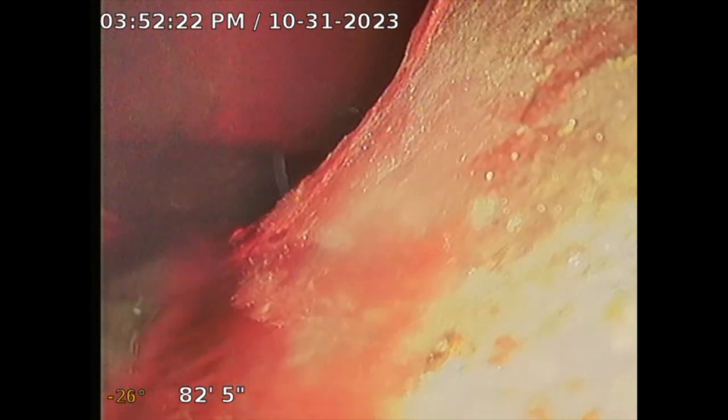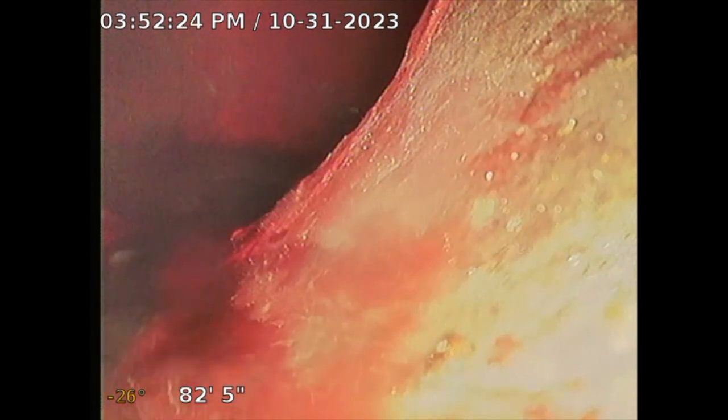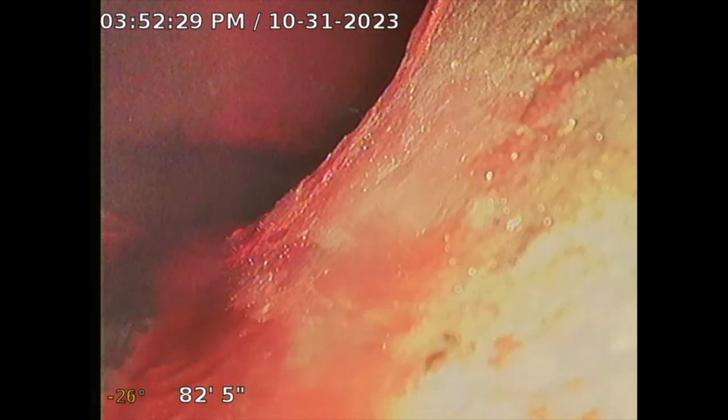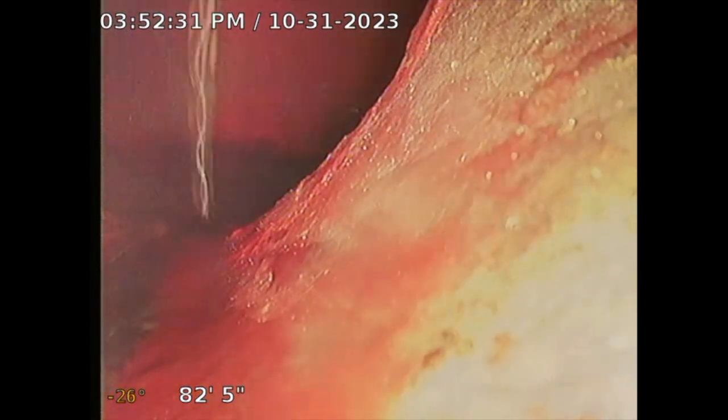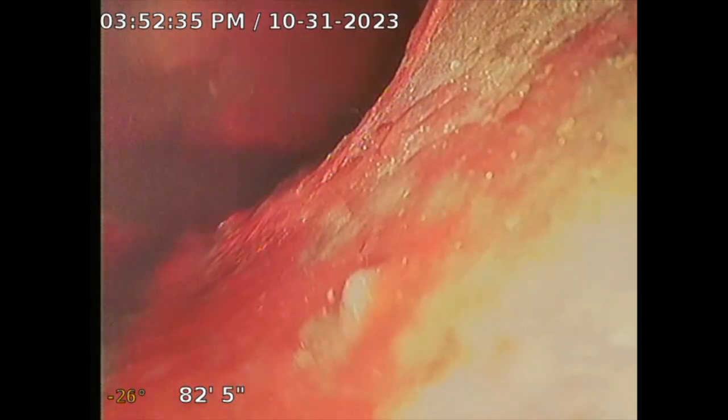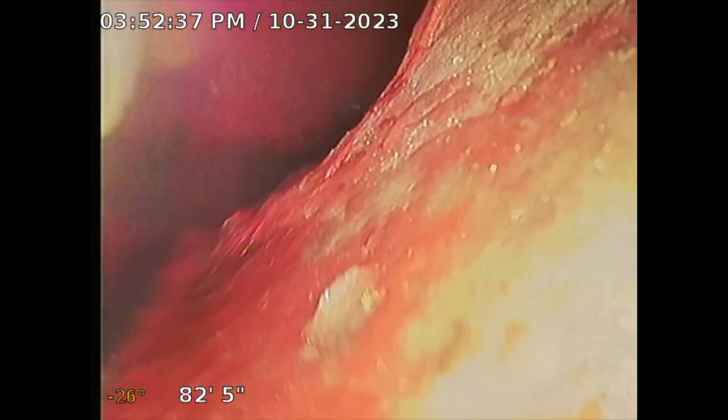But I didn't see that. And I'm going to do it one more time to see if we see a gush of water. But that's the front of the property. The ADU didn't give me a flush here. So it's telling me that it didn't get proper slope on the pipe probably. So I'll back it up just so we could see the water. That's the front.